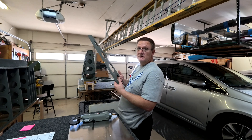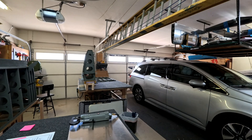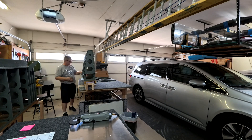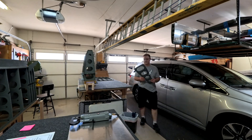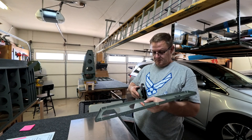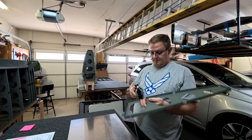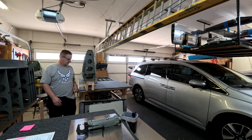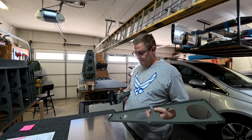Otherwise you're going to be buying new ribs! The instructions are pretty clear - they say dimple the bottom of the rib and don't dimple the tops. That's why, at least that's why I'm assuming. It's sound advice because you don't want to dimple those first four ribs since you'll have to countersink them.